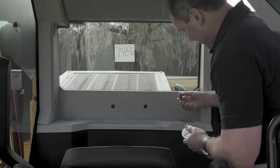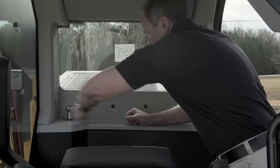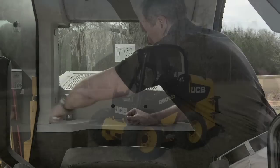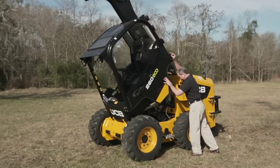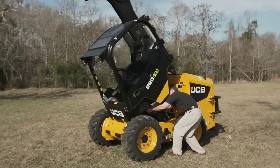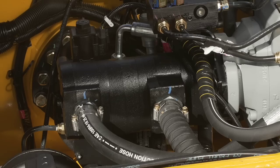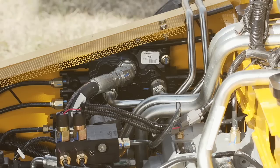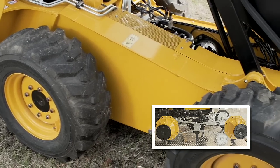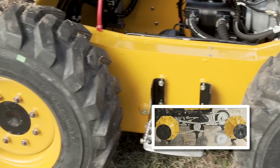To gain access to the mid-ship of the machine, there are two 24mm fasteners behind the operator's seat, and when removed, the entire cab can be raised, providing industry-leading service access to the internal components, including the hydrostatic pumps, main implement and optional high-flow pumps, main control valve, drive motors, individual left and right-hand chain cases, and other optional hydraulic components if fitted.